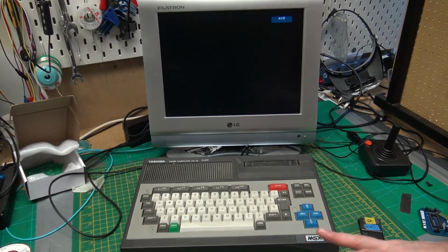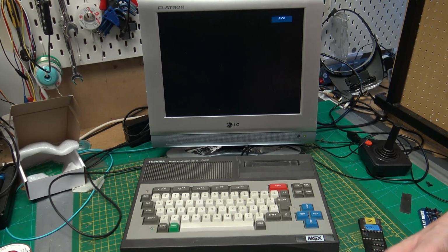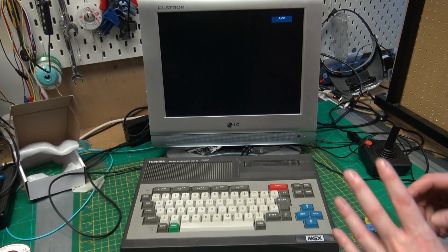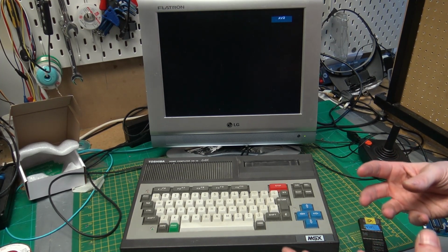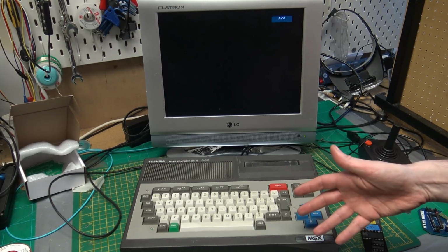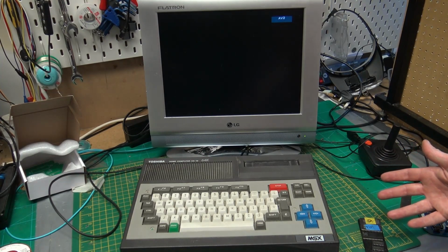I have two programs that we're going to be testing. One of them is a diagnostic program, one of them is a memory test program. The diagnostic program is by Nightfox & Co. I'll put a link to the website where you can get the files. You could actually buy a cartridge in the description. Like I say, these cannot be run without a working ROM in the system because they use OS-ROM calls. So they can't be used to diagnose a system that isn't working already.